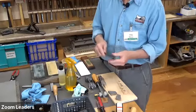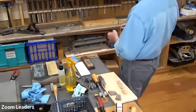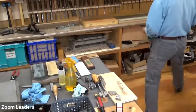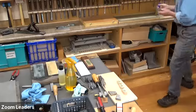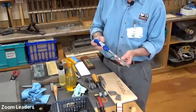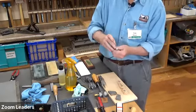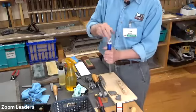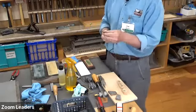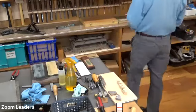It matters. It's also a paring chisel. A mortising chisel, you're going to want something even rougher. This is 35 degrees, and it could even be 35 with a 5-degree micro bevel, because really you're just pounding through the wood, typically, and then levering it out. So if you had this at 25 degrees, you'd be breaking the tip off within minutes, really.